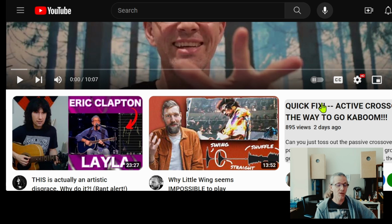And that's what I'm going to explore today, and we'll show it to you that even if you have like 3 pairs of amplifiers, as in the case of this specific question I answered when there was a 3-way loudspeaker in question, or if you have a 2-way loudspeaker in it, 2 pairs of amplifiers, 4-way loudspeaker, 4 pairs of amplifiers, etc. As many different drivers you have, where the passive crossover is splitting it to how many ways, that's the number of amplifiers you need to make a fully active system.